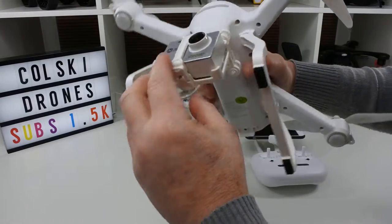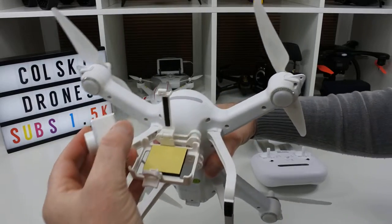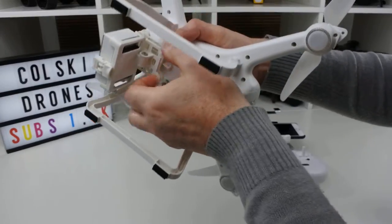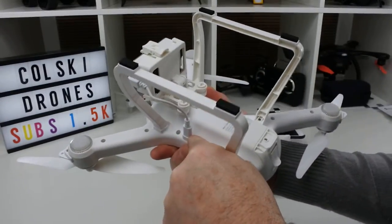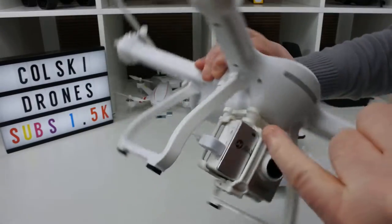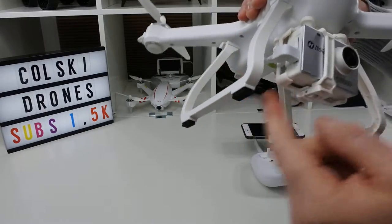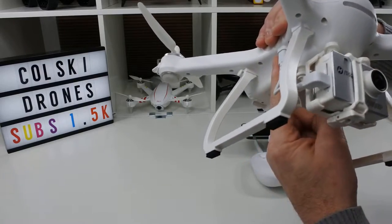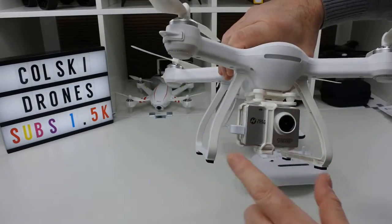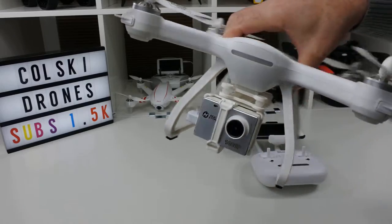The camera just fits into the front here. You get two bits of foam with it — with the thicker foam in, if you use the thinner foam you can fit a GoPro 3 or 4. It simply pushes in and a little lock holds it in place. This cable plugs one end into the bottom of the drone and the other end into the camera. You just need to put an SD card in. If you use a GoPro 3 or 4 with the thinner sponge, it will fit the frame, but it won't work with this cable — this cable allows video out from the camera into the drone through the WiFi system back to the app. The GoPro doesn't have AV out that works the same way, so if you have a GoPro, yes you can use it, but you have to set your camera up how you want and just fly without the app.